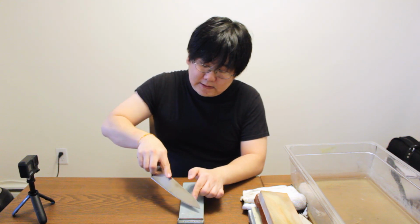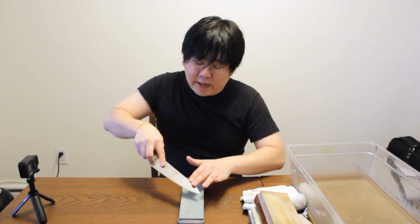Now make sure that you're sharpening both sides, not only one side, but both sides. And again, at a very extreme angle, you're just going to repeat this over and over again until your tip comes back. Now hopefully, by doing that for a few minutes, you'll have a new tip. In some cases, it can take 5 minutes or so. I've fixed tips in a fairly short amount of time, but majority of you guys, it's probably going to take a little bit longer. So be patient and keep working until, again, the two sides form and create a new point. That's going to be your new tip.